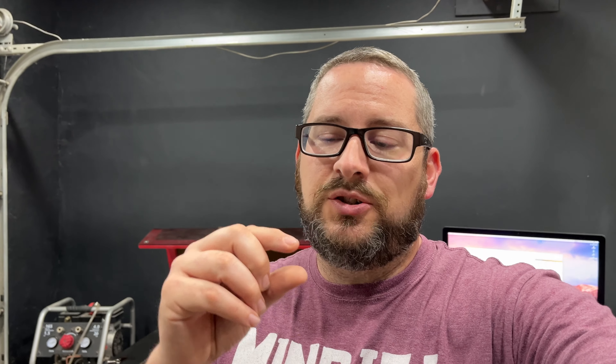On the autofocus: the reason I got the autofocus version is because I wanted the separate motor so I can just press buttons to raise and lower the bed. I don't use the autofocus feature itself because I engrave different types of material and can't be limited to just one height. The manual focus version can save you a few hundred dollars, but you'd have to rotate a knob to raise the bed. I'd rather press a button and have motors do it. So don't get the autofocus for the autofocus feature — get it for the motorized bed.